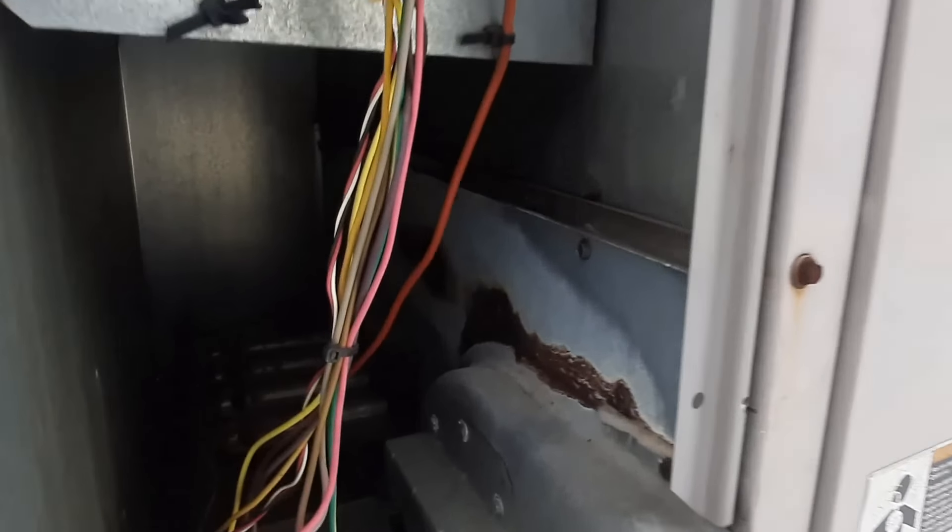I'm going to take pictures of all this. You can see the compressor - this is an old R22 unit. I don't know how long the evaporator's been in that condition but that compressor hasn't been a happy guy either. It's a wonder we haven't had a call on that. I'm going to clean up in here a bit more and clean the blower wheel. I think the temp rise will be better now - the heat exchanger doesn't look bad, I don't see any cracks, and we didn't get any flame rollout. Thank God York makes them better than Carrier - this would've never lasted as a Carrier unit.